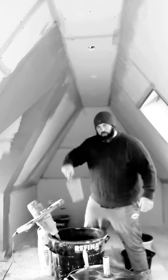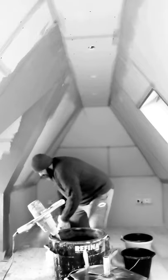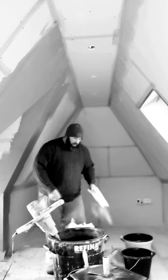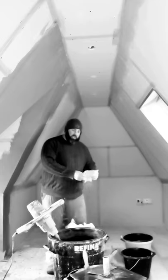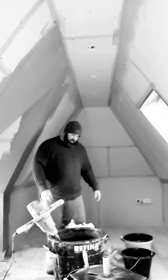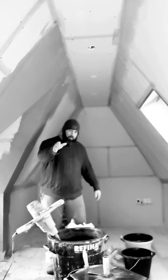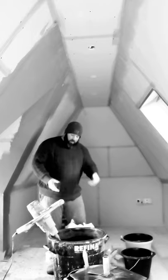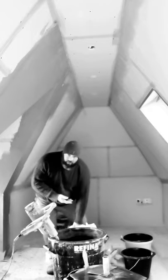So your bucket trowel. When you're mixing up, clean around the edges and put it in, okay? So on the bag of plaster, you'll get a lip on the end. Pull it right off. Right, I've seen, believe it or not, people struggle to open these bags up. Top, rip it right off, pour it all in. This is your first bite.